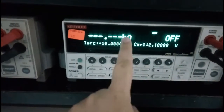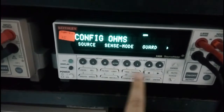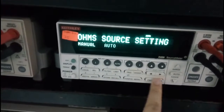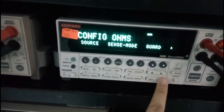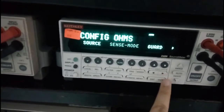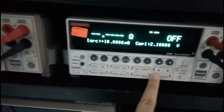In resistance, then I go to configure, configure the resistance value. The source — I want it to be manual source. Enter for the manual source. Sense mode, four-wire, and then I go to fix it.